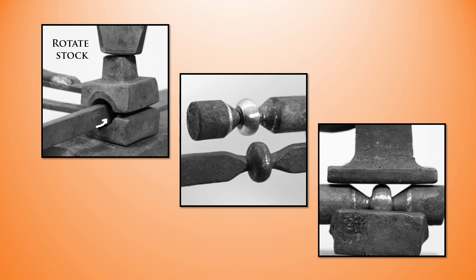I'm going to substitute a one-inch round bar for the three-quarter inch wide flat bar that we're going to use on the central style. But remember that the flat bar has to be measured across the diagonal to get a more correct clearance measurement, and at the very least the welded collar has to finish at one inch in diameter as per the drawing.